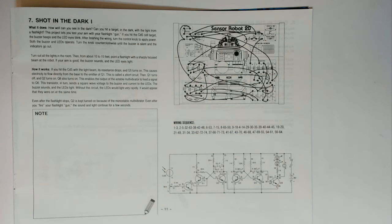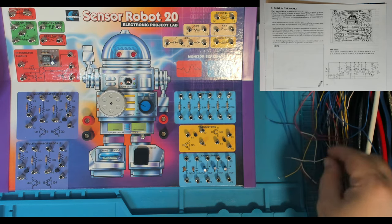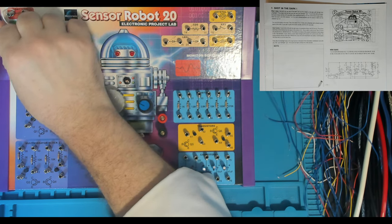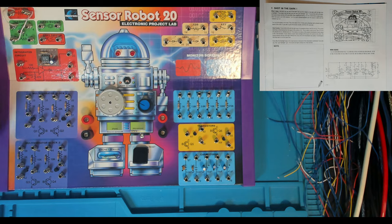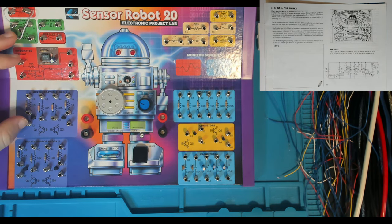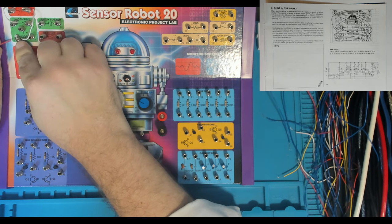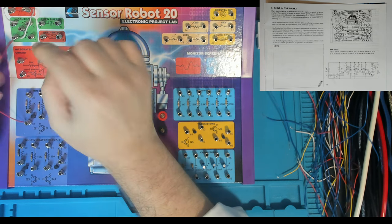Let's pop it over here and wire this guy out. We always start with 1 to 3 - I left that wire in there because that's always there. And then we've got 2 to 5. So 2 to 5 is connecting the negative power terminal over to one side of our control potentiometer - that's a variable resistor of course. And then we've got 5 to 32. Now 5 to 32 is wiring in our Q1 transistor in our multivibrator block 1 down here. This is the emitter - the emitter of Q1 - that we're connecting to the potentiometer.